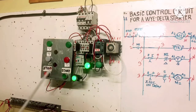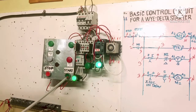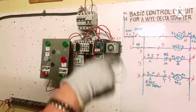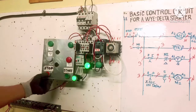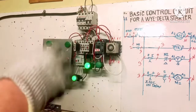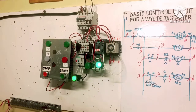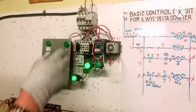The purpose of this system is: when the start button is pressed, the heavy motor draws high inrush current, and Y connection accelerates gradually to speed before transferring to Delta. This is the engineering design — very smart. One more time: energize Y, start with Y accelerating — one, two, three, four, five — then transfer to Delta. It counts one, two, three, four, five, six, spinning, then transfers to Delta.